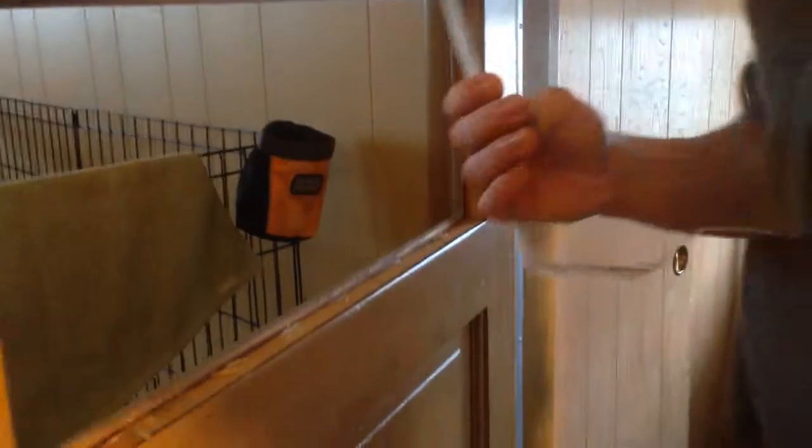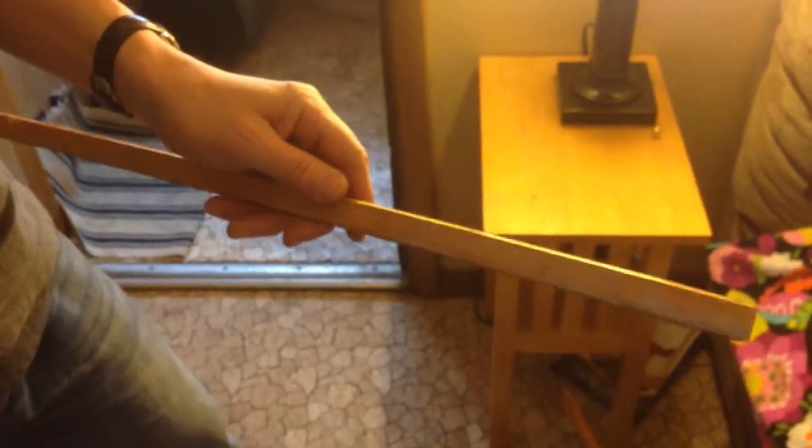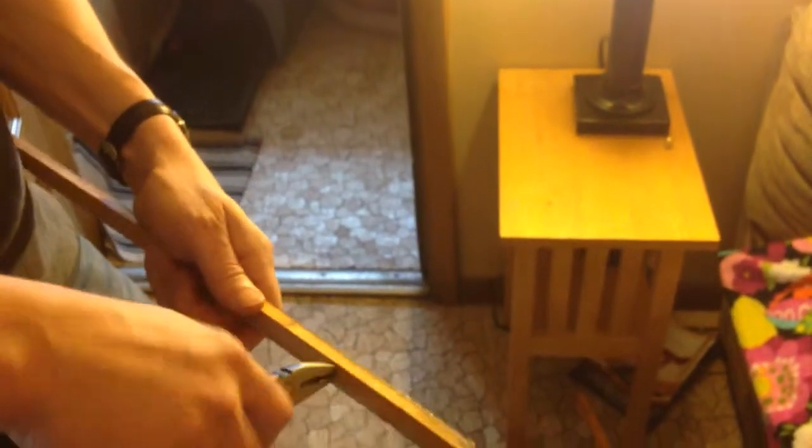Now let's see if they used some glazing — if they did, there it is. So we've got these brads; they're probably newer and were definitely put in with a nail gun. You can see the opening is real wide from when that went in. Depending on the nail, it might be real tough to pull through. If you've got a piece of baseboard or some wood trim or a window sill, you might be looking at huge six, eight, ten penny nails.